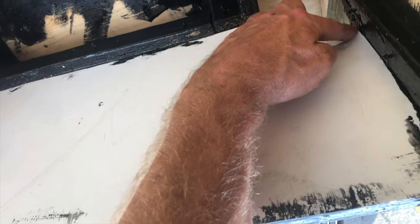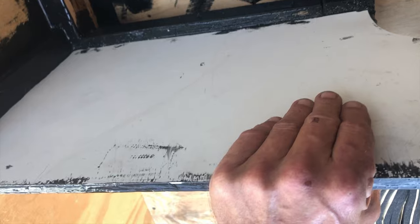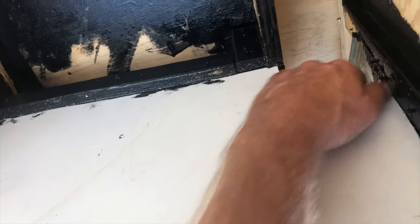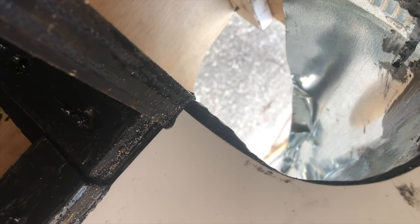We're extra sealed around this edge. We've got a good dam built up all the way around it, so the water is definitely going to overflow. Condensation water, that is definitely going to overflow this one spot every time. Even sloshing, turning corners, hitting the brakes, whatever, it's going to flow out there. And we're sealed real well, and it will slide right down that tube and out the bottom of the van.